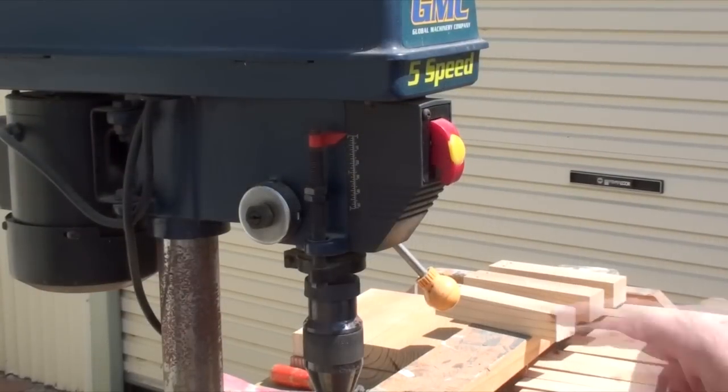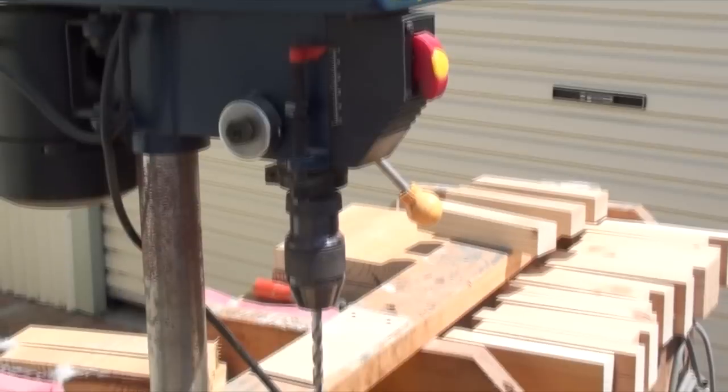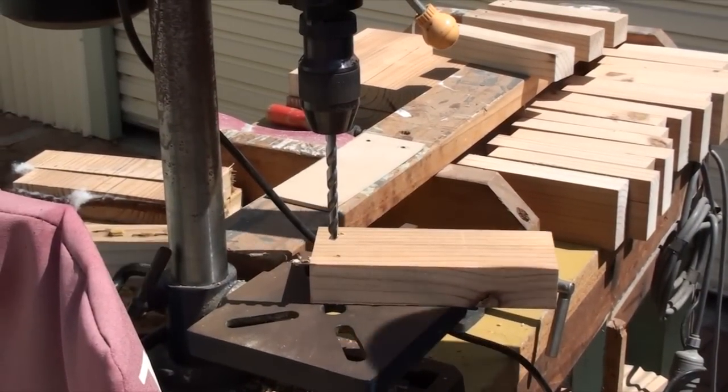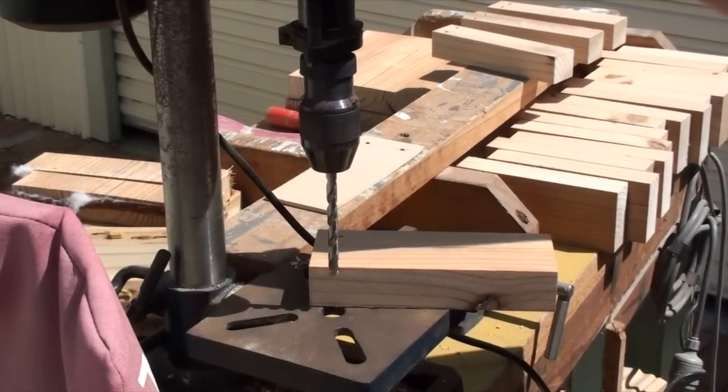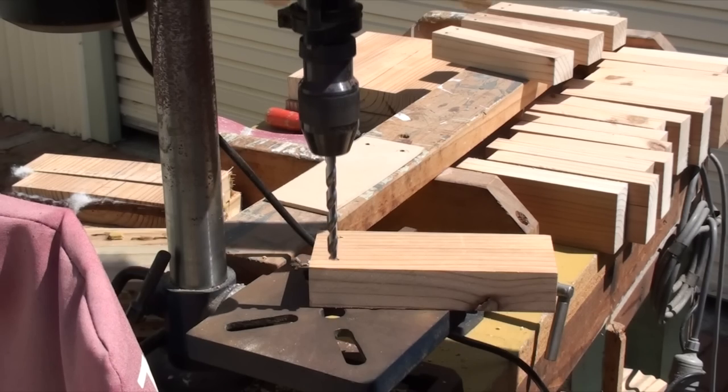Another point worth remembering, if you have a drill that has an adjustment on it like that, where you can set the distance a drill travels, it's worthwhile making that adjustment so that when you are countersinking, it will just go down to the required amount and then stop, and that way all the holes are the same length.